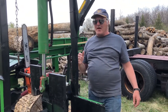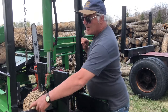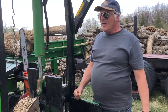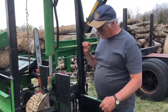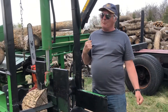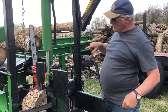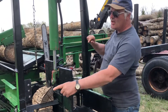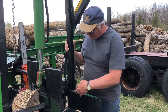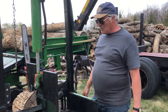What I did then, worried about the amount of stress on everything, was to put a foot on the back of the cross wedge and let it hit this plate, which would take some of the side load. I'm not sure that's necessary. What has happened, though, is because I've got a flat edge here, every now and then I'll get one come through, twist, and come straight through — and with 26 tons behind it, it expands it. If you look carefully, you can see the surgery that's been done to put it back together. So this winter I have other ideas for it, but having a flat corner like this in the crush bed is not a good plan at all.